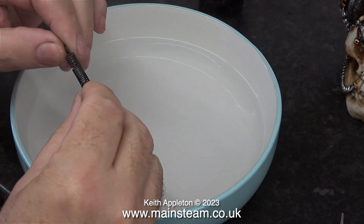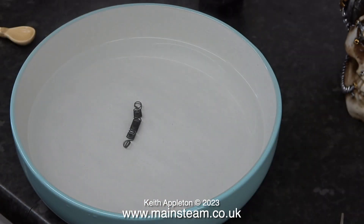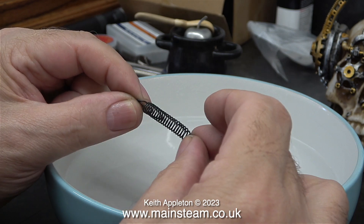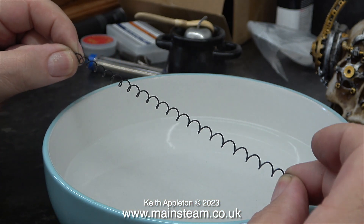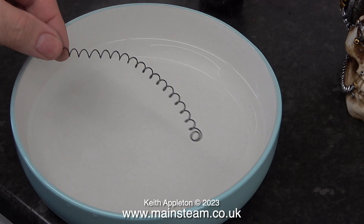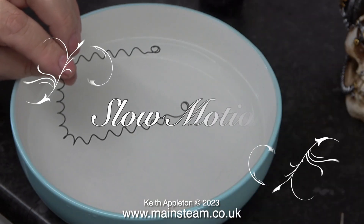Apparently, if you heat this stuff to around 500 degrees C in any shape that you make it into, it will remain there — and that's what it will jump back to once you put it in hot water. That's why my particular nitinol spring doesn't look very good, because I abused it. As you can see, I can push it back into position, but what I would need to do is heat it to a very high temperature to make it memorise the position. When I first saw this in Andrew's workshop, I couldn't believe it. This is at 100% normal speed, and you can see how quickly the spring returns to its original shape.